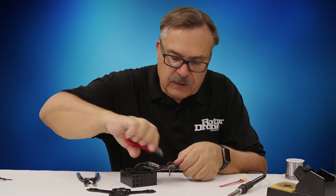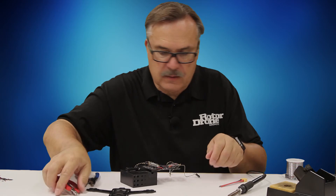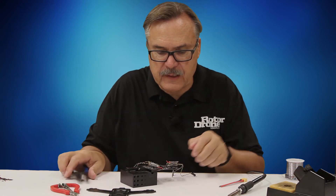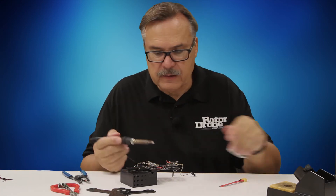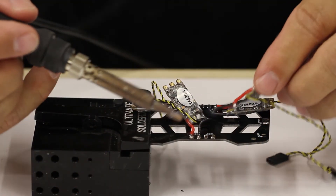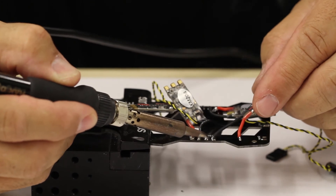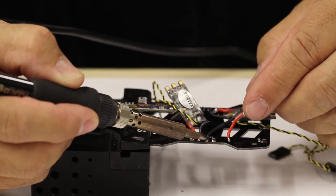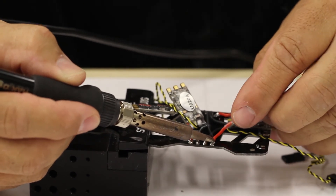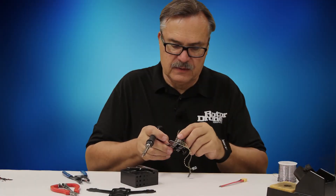This one is a little bit long — that's going to need to be a little bit shorter. I'm just going to trim off a little bit here, and now I can tin this up. Clean off the iron, a little solder on that, right on there. You can see just how fast this actually happens — you just touch it down and it instantly melts. Once there's a little bit of solder, that's a transfer of heat. It's very, very fast.